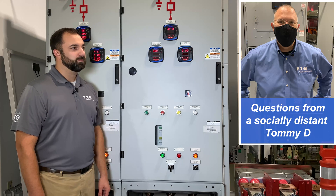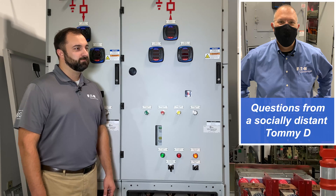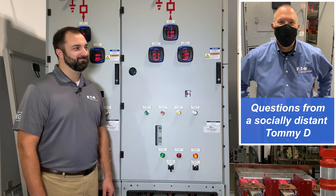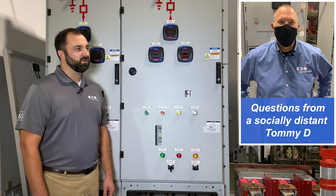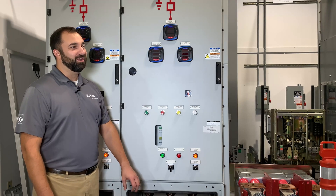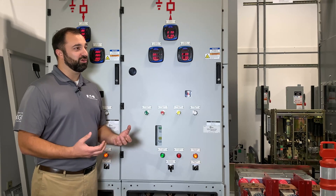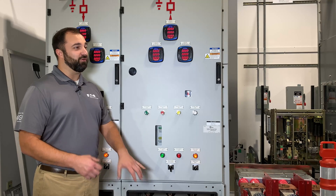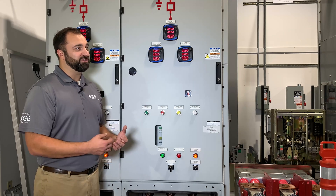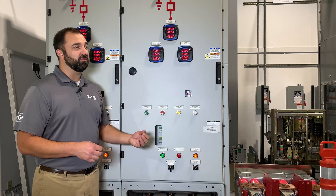Small is really good from a design perspective and for small footprints. But every time I talk about smaller equipment with the electrical worker, they're always saying, 'Oh boy, now you're going to fit me into a tight space.' Do I have this same concern with this piece of equipment? I'm a pretty big guy myself, and I've been inside the cable compartments down here at the bottom — I've connected cables, put things together down there, removed components. It is tighter, yes, but it's a very workable space. The XGIS gas insulated switchgear is all front accessible for your medium voltage cable connections — very easy to get in there and connect those. If you're familiar with installing a pad mount transformer from Cooper, very similar elbow connectors are used here to install the medium voltage cables.